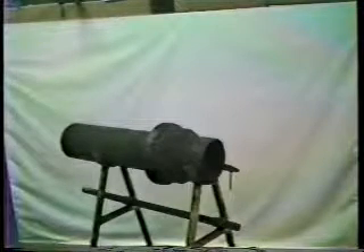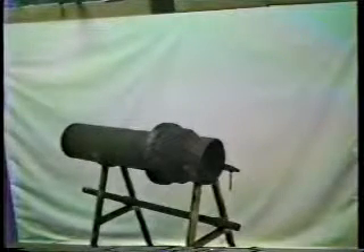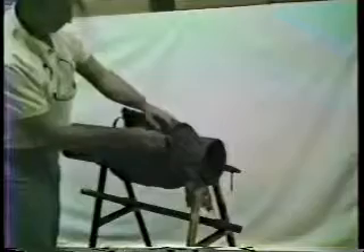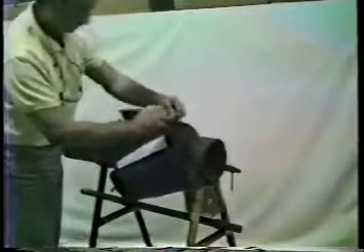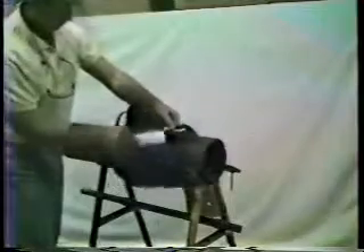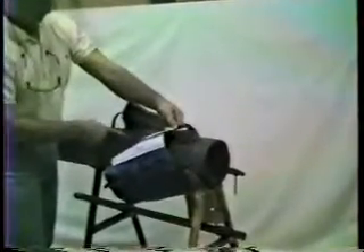Here we are not actually priming because we need to get the sealant off this pipe afterwards. Wrap the mold around the joint with the neck at the 12 o'clock position. Close the zipper and with one hand underneath, carefully press the velcro together firmly and evenly to create no wrinkles.